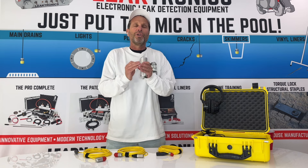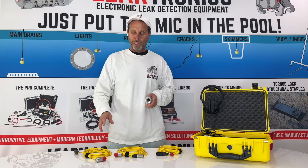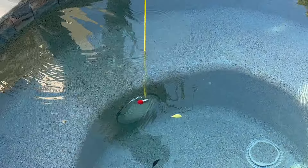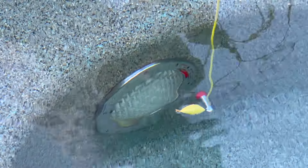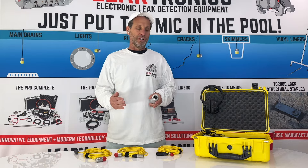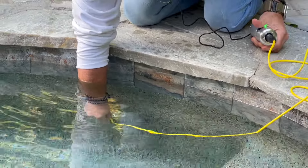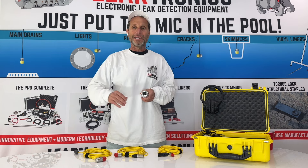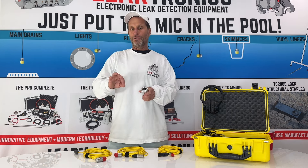The Redhead mics provide an incredible dynamic sound. The pipe mic is for plugging in and listening in pipes. The SM1 is the side mic, used for listening on walls — for things like lights, side suctions, structural cracks, or returns. If you hear that rush of water you're looking for in front of a return, throw the pipe mic in — whether it's a spa jet, return, side suction, skimmer line, or any other plumbing. If it gets louder as you push in, you're getting closer to the leak. If it dims out, you've gone past it — pull it back, mark it out, and you're good to go.